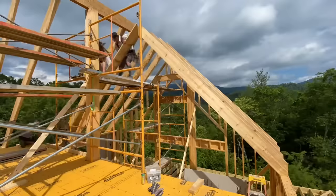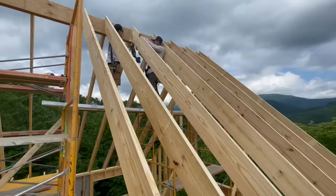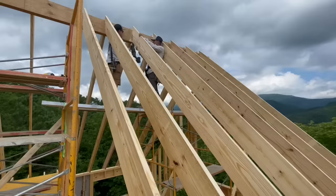They also carry some shims in case the rafter is a little too short. What you do is actually space it out from the ridge beam just a little — in essence, making it longer.